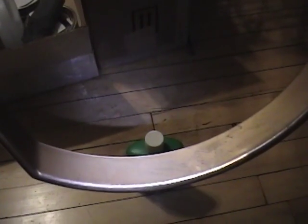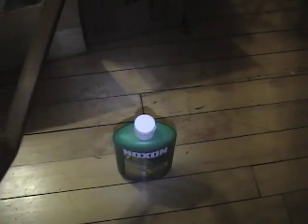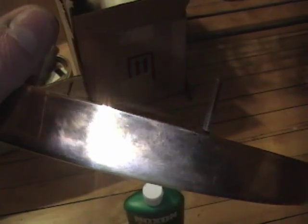I tested the screen bezel with a magnet and it didn't react, so I'm pretty sure it is pure brass. I then tried polishing it with some Noxon and pretty quickly determined that it has a coating on it. Once I wear through that coating it does polish up real nice - like on this front edge - but you can see where it transitions to where the coating is still on. That's probably lacquer, which they would quite often put over brass so that it wouldn't tarnish.